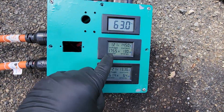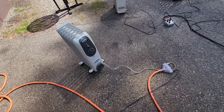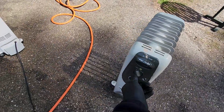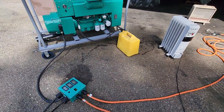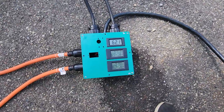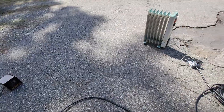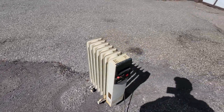Still got good hertz — 1700, 1600 watts. We're doing good, that's only two heaters. Turning on more now. Listening to the motor — virtually no difference in pitch, which is good. Now we've got four heaters on full. Let's see what we've got for a load: about 6200 watts, good hertz, good voltage. Let's turn the next ones on — didn't really hear much difference in the motor at all.